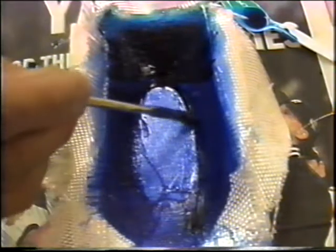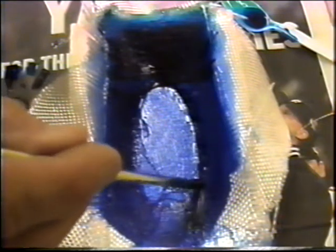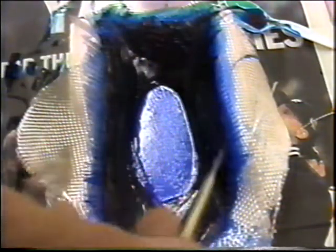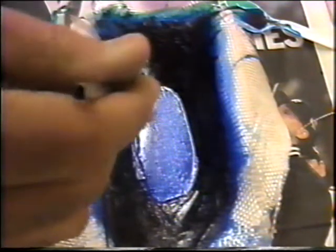The last thing, I wanted to put a couple little reinforcing pieces right on the edge here. And this is the side that'll get cut out for the muffler. So a little bit of a reinforcement there will be a little cheap insurance. Now I finished this up by just adding some of this Dave Brown carbon fiber tow, and you can see how nice it spreads. As the epoxy starts to kick off and get sticky, I can just keep patting it down into the corners. It takes a little touch, I guess. Otherwise you get the hairs and it all pulls up. You can just keep feeding it down. Once you get this little technique down, boy, you're home free.